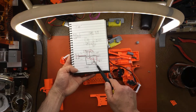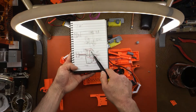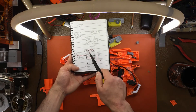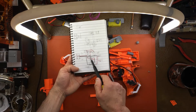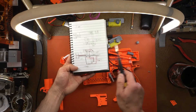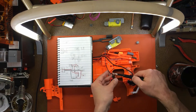This comm has to go to positive, and also to the normally open of the pusher motor switch. Comm here is going to go to the positive terminal of the feeder motor, and the negative is going to go to the normally closed. The second is going to go back to the battery. So this right here — the normally closed to the negative of the motor — that is the second braking line. This short little one right here. That's your braking line.